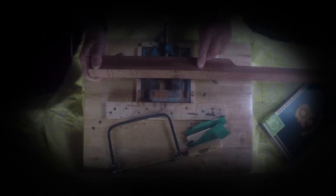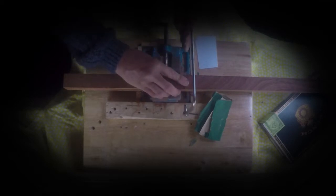Right, the observant people would notice that even though I'm cutting these dead out to 2mm and I'm going to chisel these 2mm bits out, it's not that important for this cut to be 2mm. I'm doing this as a guideline and then I can recut down afterwards. I don't want to cut down and cut down and cut down. I want to do it this way, my way. I want to chisel these out to 2mm, and then anything on the inside of this doesn't really matter because we're going to have to go down a little bit more to accommodate the pickup, which obviously is going to be somewhere in this area.